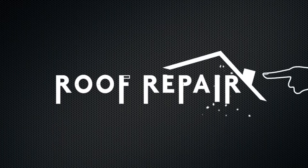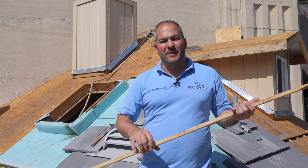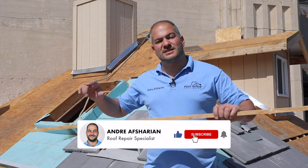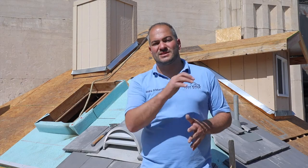In this video, I'm going to show you how to install tiles with a batten system. Battens can be made out of different things, the simplest of which is a 1x2 piece of wood installed on the roof. The idea behind battens is that they're installed perpendicular to the slope of the roof and the tiles actually hook onto them. This is really meant for tiles installed on roofs past 6:12 — so 6:12 and steeper by code need battens to make sure they don't slide off.